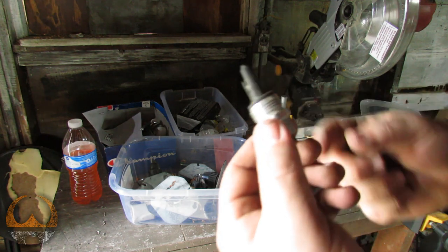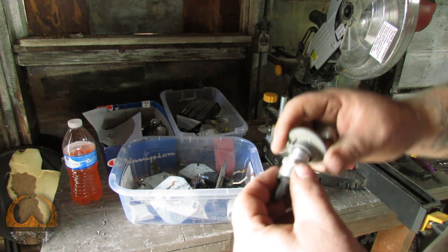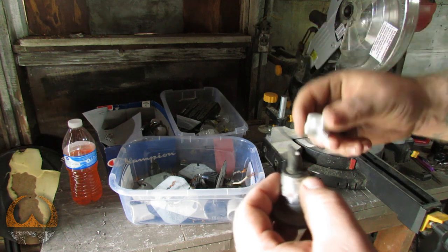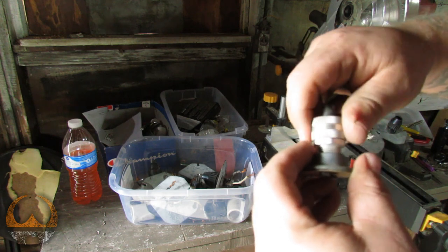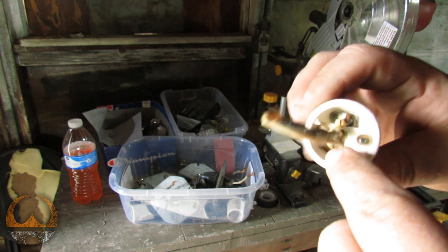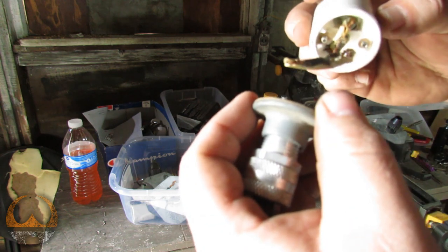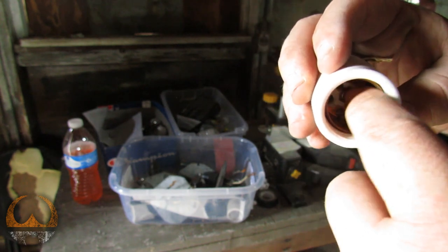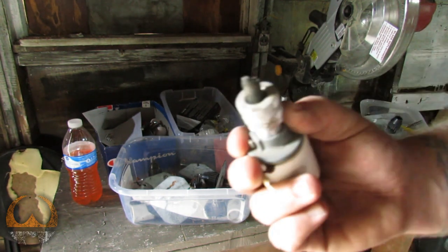And then here is one with wire run through it already. That runs into this little itty bitty plate. Again, that grommet holds, this tightens, and that's what holds it at the other end. Then this gets wired in here inside the ceramic socket housing. And then this goes back on it and gets screwed to that through there. There's two tiny flathead screws, and then that goes back together.